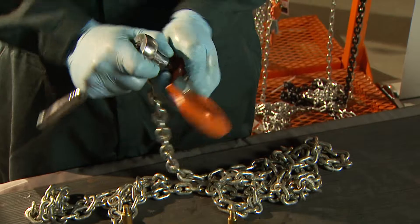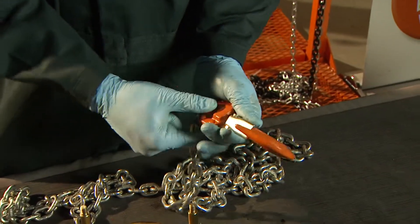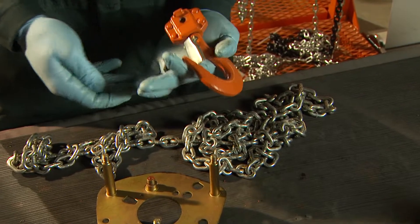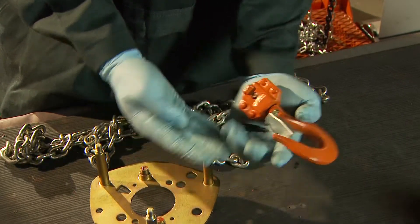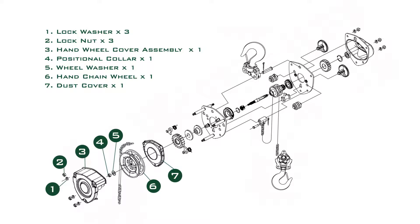Remove the lock nut on the bottom hook shaft from the bottom hook assembly. With the hoist disassembled, all parts can be cleaned, degreased, and air dried. Measure hooks to ensure there is no stretching or twisting. Inspect pawls for rust build-up and make sure they have full range of motion. Check load sheaves and gears for cracks or excess wear. Inspect the chain for stretching, weld spatter, rust, corrosion, and any visible damage. Ensure the name plate is legible and the warning tag is still affixed. After cleaning and final inspection of all the parts, the hoist can be reassembled. Here is a list of parts you should have for reassembly.